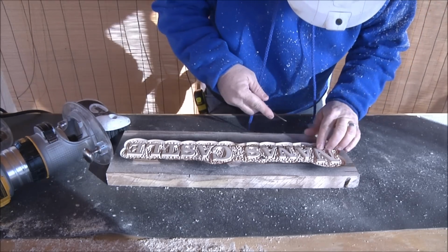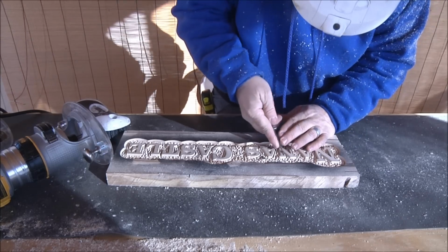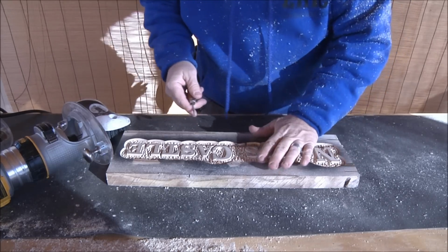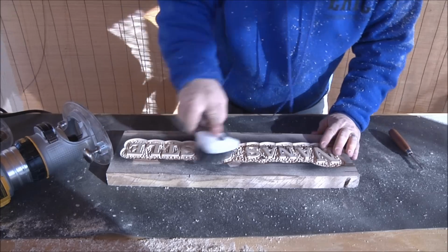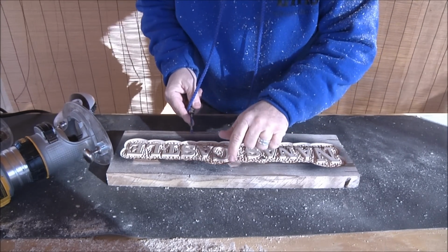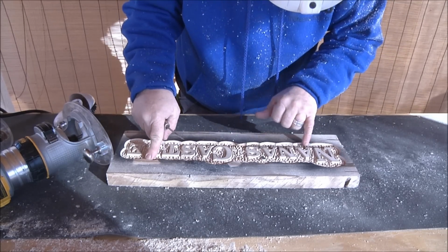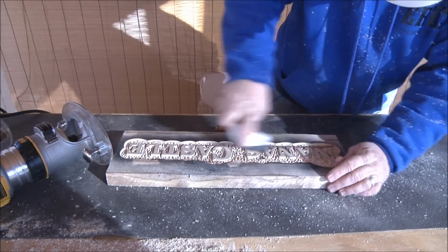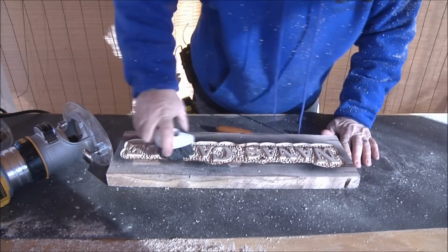I'm going to go ahead and brush this really good, guys, and then spray it. Now I don't have any sanding sealer on this because I didn't sense that this is going to be a wood that's going to bleed. So I'm going to brush it real good, and then I'll spray it, and we'll come back and sand it off. I will put a piece of tape over that hole and probably that one. These two are in the background. And this one, I didn't have any issues with. But yeah, I've got to really brush this thing good. So we'll be back in a minute.